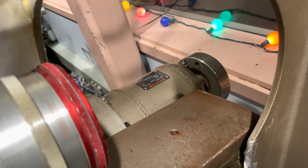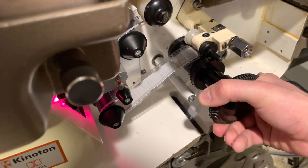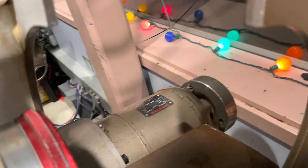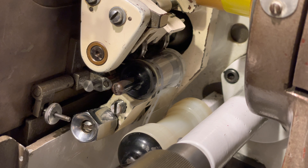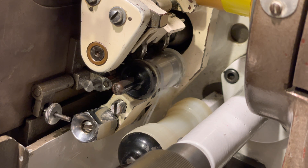Now we want to check the advance — a trial film advance. We want to do this by hand. The manual says to use this right here, because you can twist it and move the projector forward. But we don't use this one because it has snapped off on us before. So we actually advance it using the motor flywheel over here. I'm going to slowly advance the film — you can watch it right there. You can see how it's advancing. That's our intermittent loop right there. I'm watching the film to make sure it's not falling off, and it's moving smoothly. I don't see anything in the way, so I see no issues.